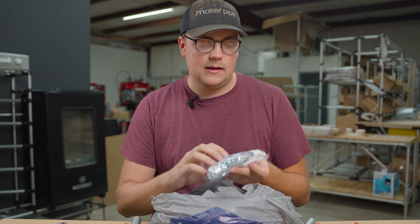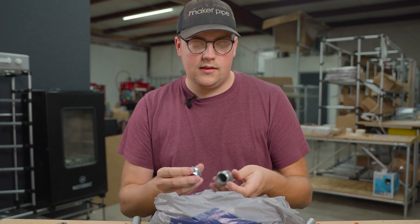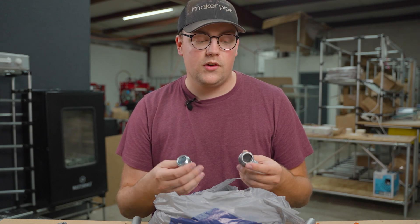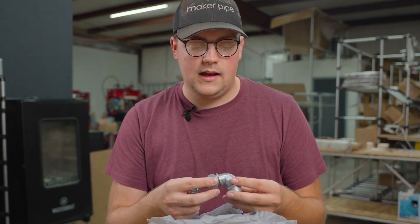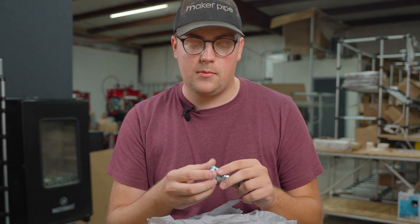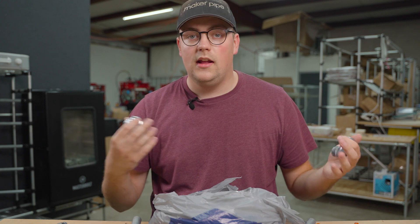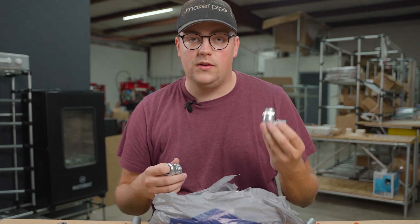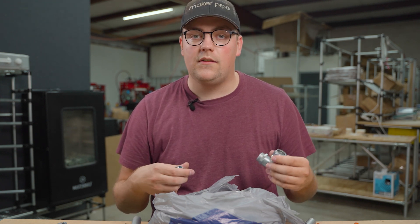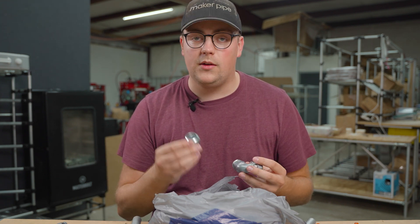This is the same kind of connector except for three-quarter-inch EMT conduit. I also want to point out a difference here: you'll notice this one has a more dull metal finish without the sheen of the other one. When you find these fittings off the shelf, the duller one is made from zinc — it's not as strong but it is cheaper than the steel counterpart. However, zinc is less likely to rust than steel. So in situations like on a coast or where there's a lot of salt, people will use zinc fittings. All of these things are meant for specific situations, so you have to follow the code and see what is recommended for your application.